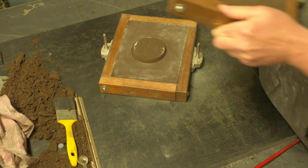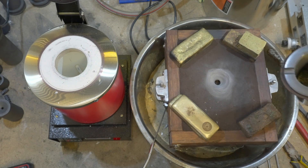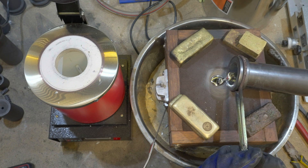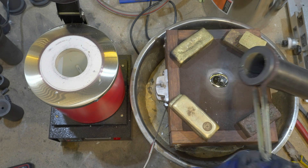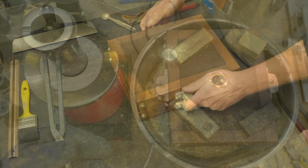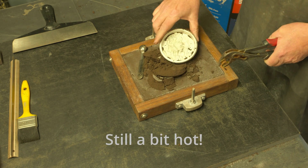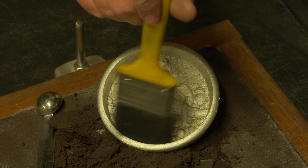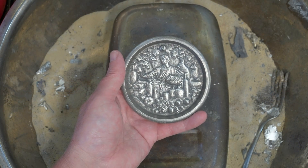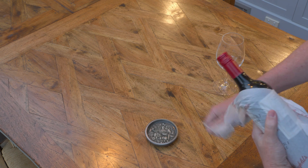With some luck it pulls out — cleaning is always a nervous bit, wondering how much sand you're going to tear out — but it looks really good, nice and clean. So we're going to reassemble it and get ready to pour the metal. This is pewter running at 275 degrees; it's taking about half a kilo of pewter to actually fill the mold. Compulsory shot of the shiny metal, and we'll let that freeze out, open it up. Here we are just removing the petrobond — as you can see we've got a nice clean casting, just brushing out the sand.